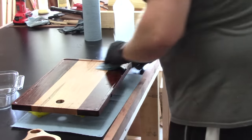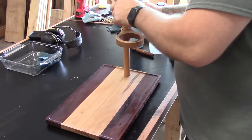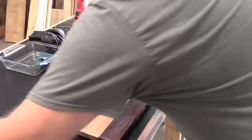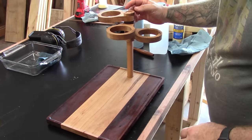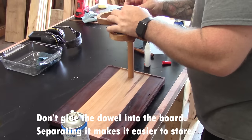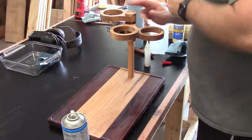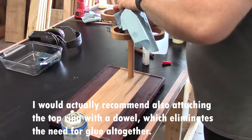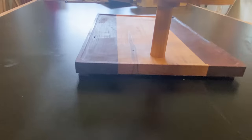Then let's take some mineral oil to our board itself — going to do two coats of this — and then let's move on to assembling everything together. We put each of our trays in, separated by one of our little walnut separators, and then we'll put the last ring on top. Now you'll notice it's a little bit wobbly. I can cut down the size of the hole end of the board just a little bit, but I want it to be loose enough that it will fit down inside there with a friction fit. The top, however — I didn't like the fact that it was wobbly — so I decided to glue on that top ring so it actually holds all of the trays in place. Instead of using wood glue, I decided to use some CA glue because that will lessen the likelihood that it will drip down onto the tray and glue those in place. And once we're finished — here we go. There are some improvements that could be made, but overall I think this is a great project.